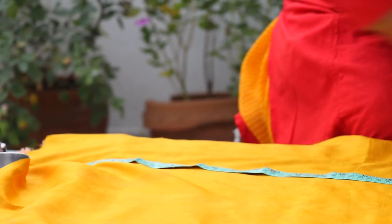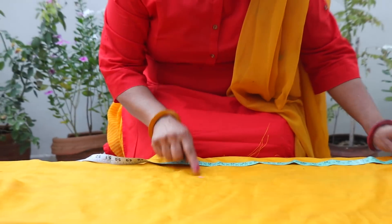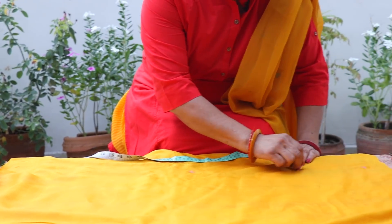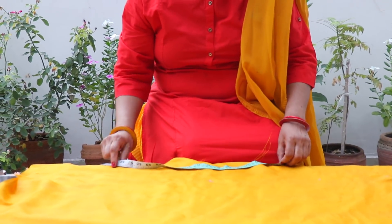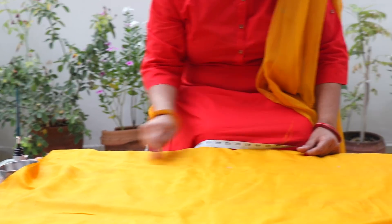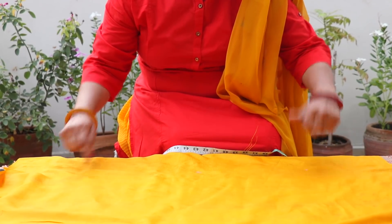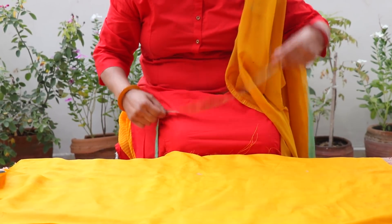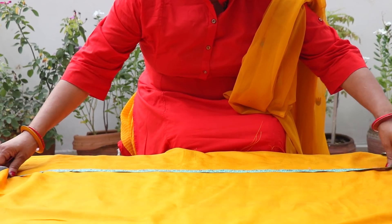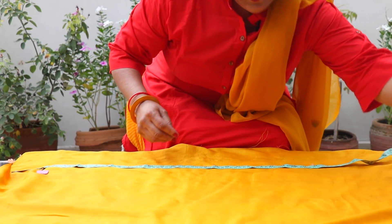Put a corner mark here and one on the left side corner. I have marked here, one in the center, and one on the side. Now we will mark across. This is our first row. In the second row, we place the block in the center between the first row marks, so the pattern is offset. In the first row we place 5 blocks, in the next row 4 blocks, and in the third row 5 blocks again.